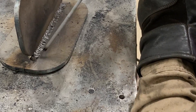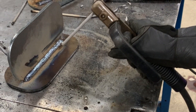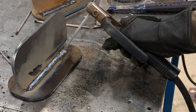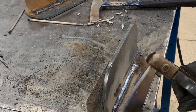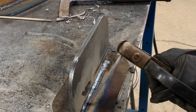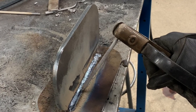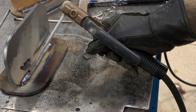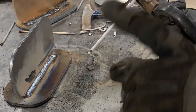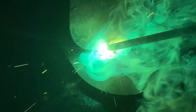Here I'm just showing positioning yourself and being able to brace with your elbow. Another important thing: if you're working off a table, try to get the piece you're working on close to the end of the table so you can burn a whole stick electrode. Otherwise you can see how hitting your stinger on the end of the table could give you some problems.